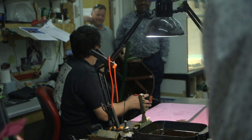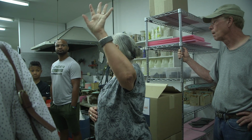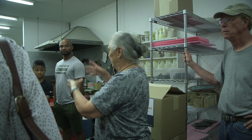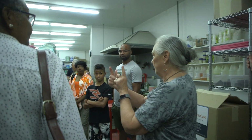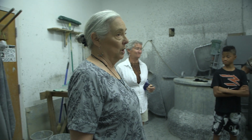Okay, and so once the waxes are finished, the sprue system is complete, then everything goes next door into the ceramic shell room. Then we make another mold, again, around the wax and inside the wax. And so if you'll follow me through, we'll try and head over that way. Okay, and so in this room, we create what's called a ceramic shell mold.